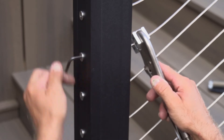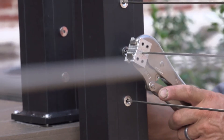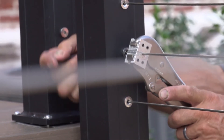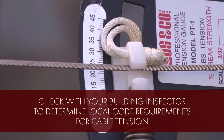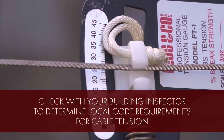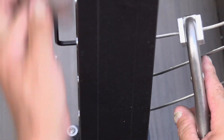After all the cable has been placed, Chris tensions each strand of cable using an Allen wrench on one side and the cable vice grip, available through KeyLink, on the other to hold the cable tight. The tension gauge lets him know when he's reached the appropriate tension. When tightening cable, make sure the cable is not spinning, which could indicate over tightening.